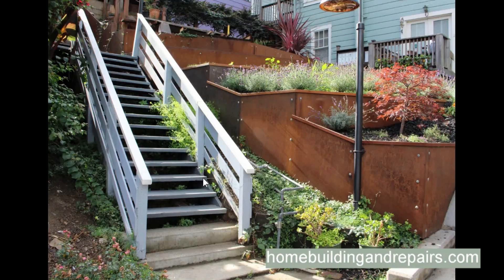Here's a good example of what I was talking about where the treads are not in between the stringers — they're actually sticking out past them. I don't like this. I don't think it would be a problem structurally, but aesthetically it just doesn't look nice. This also provides another example of a wood post not connected to anything — this doesn't have a lot of strength to it. And I will avoid talking about the different riser heights and the trip hazard at the bottom.